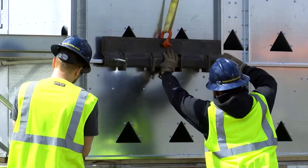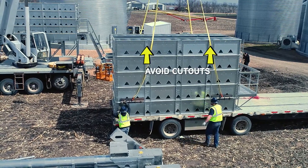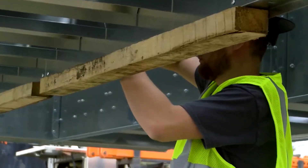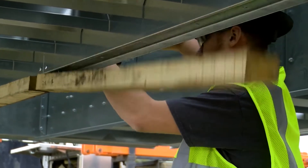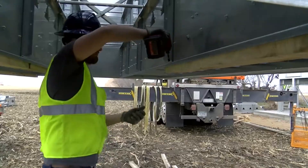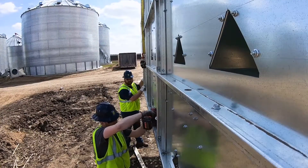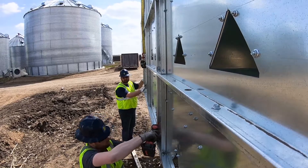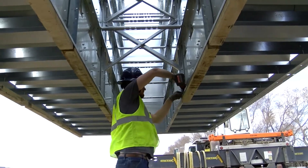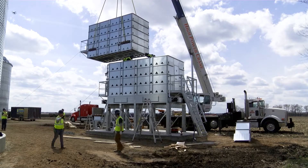Attach the lifting brackets to the section as done previously. Again, use a spreader bar or use strap protectors and avoid the cutouts at the top of the section. Swing the section up and off the trailer but keep it low for now. We have to remove the shipping boards from the bottom flanges of the section. They are screwed through the mounting holes with 5/16 inch head screws. Remove the boards from the side and end flanges as well as on the inside flanges. Keep the section low and have someone support the section so it doesn't move around as you remove the shipping boards. Make sure no hardware is attached through any of the mounting holes on the end flanges — remove if there is. Begin swinging the section over, paying attention to the orientation of the section as you do.